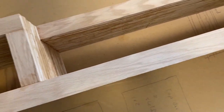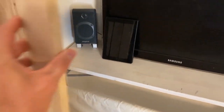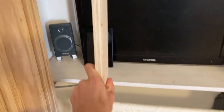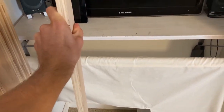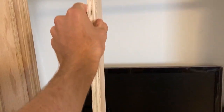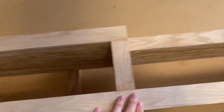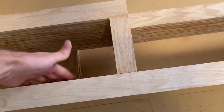So what I found is that these long slats of wood, obviously they can bend and flex this way, kind of like a bow. But if you turn them on their edge, they have a harder time flexing, but they'll still do it a little bit. So basically I'll clamp from one end, and then if I have to, slowly bend these things into place to make them really, really straight, removing any curviness that happened on the cuts of the table saw, so they fit the same really nice straight edge that I've had going for me here.